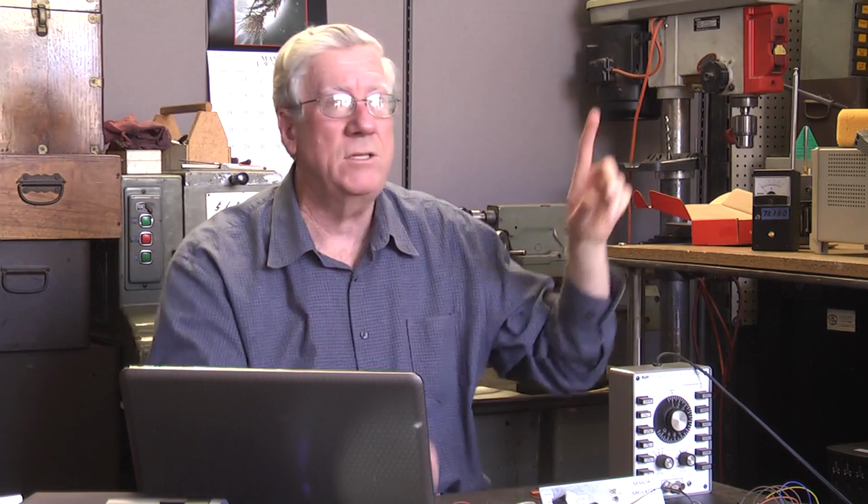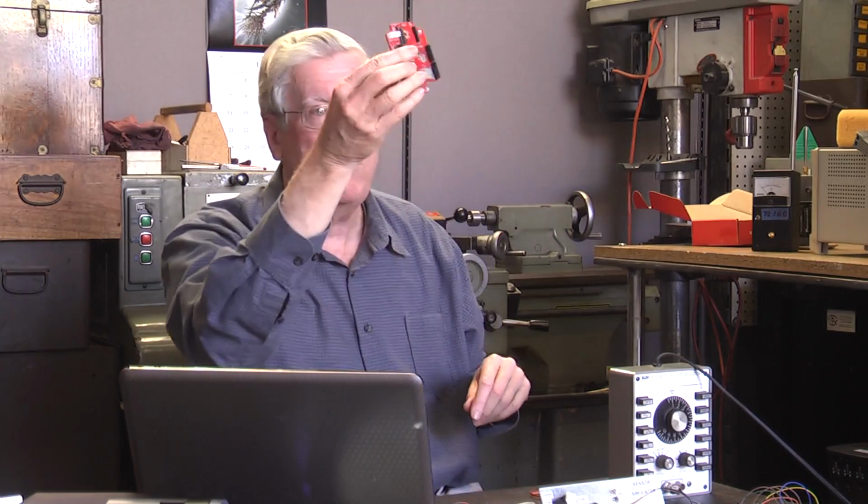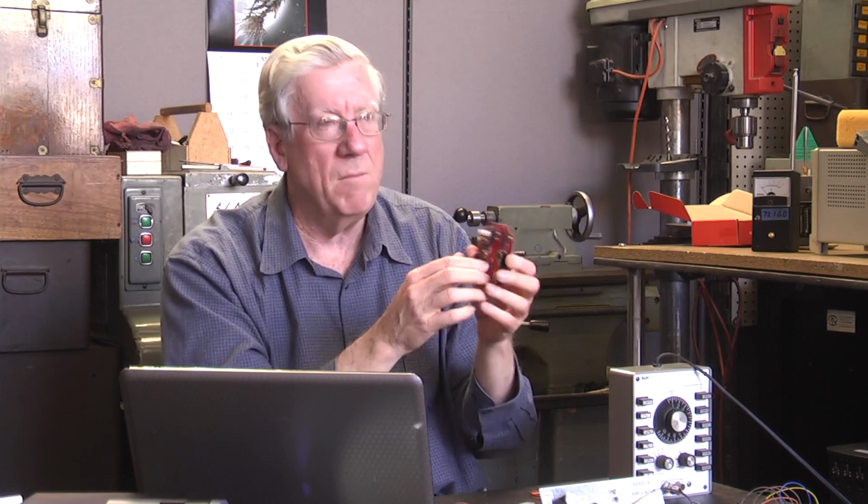They go to that serial stream, the one that is the only one of interest to the microcontrollers. And in that, they can simultaneously put them in line, and then they go as a stream. I forget the standard that they use, but it's the same one that Arduino uses. It's four letters. It's a serial interface, though, right? It's a standard serial interface. I believe it has one clock, the data, and ground. That's the minimum number of digital lines in that configuration.